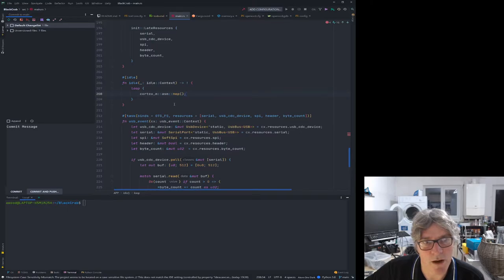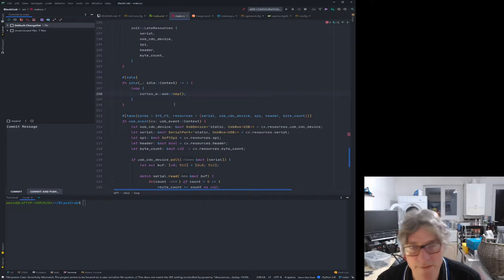So after we programmed, we probably want to set something that we can check, to make sure that we're in a position that we can then enter into an SPI transaction, because we know that our synthesized SPI receiver is running inside the FPGA.